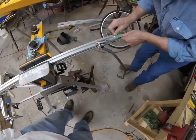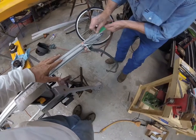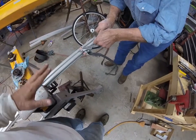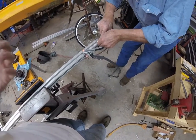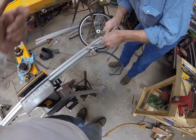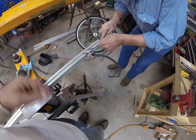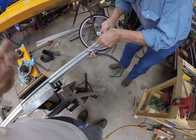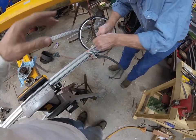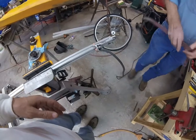What Dad's doing now is he's cleaning up this aluminum before he welds. Aluminum forms an aluminum oxide skin — within 24 hours of it being raw aluminum, it'll oxidize just the outside. Just a little skin. Well, that skin melts at about 2,400 degrees, where the metal underneath it melts at 1,200 degrees. So if you weld where there's already oxidation, by the time you burn through the outer skin you've melted what's underneath it and you don't get as good a weld. So if you clean it up, then you have about 24 hours where you can weld on it before you would need to clean it up again.